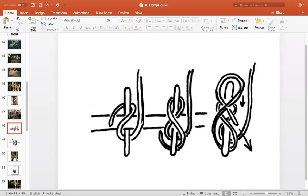And the reason for that is it's going to hold. The wraps are what holds the line. That's going to hold the out-of-weight condition, and it will hold an out-of-weight condition up to the capacity of whatever that line is, right? Or the pin, whichever is weaker. All right.